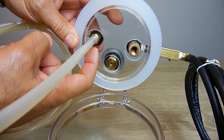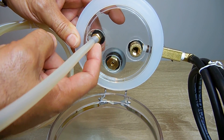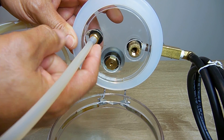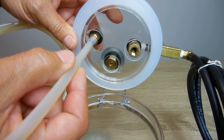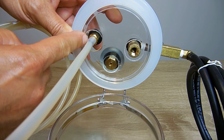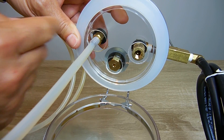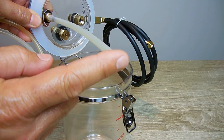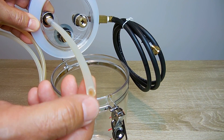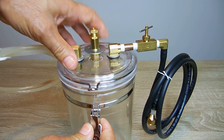This fitting is an eighth-inch female thread going to a 3/16-inch barb, and I slid the poly tubing over it. You could take a heat gun to soften it up, or place the end in boiling water to soften it, then put a little film of soap on the barbs and slide it all the way down until it seats — it'll make a nice, good seal. You're going to measure the very end and put an angle on it so when it gets to the bottom of the container it can't be obstructed, then angle it in and push it back down.